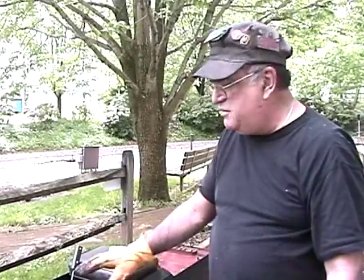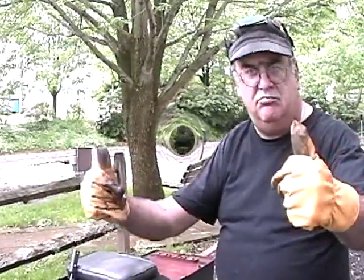Well, you can hear the engine there. It's right next to me right here. Running beautiful, man. Air compressor's maintaining at 70 pounds. I got the cutout cock off, so I don't have to worry about the tender brakes coming on, but they work on straight air too, so I work on about 30 pounds of air just running around light. Having a ball. Nobody here. Got the whole club to myself. Safety valves.